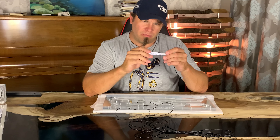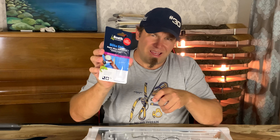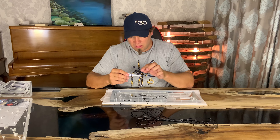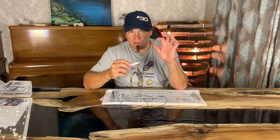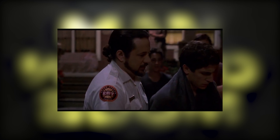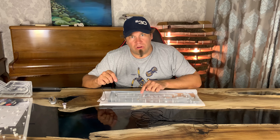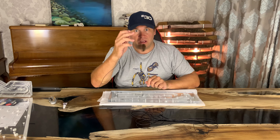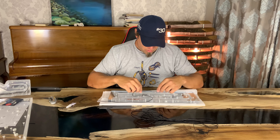Once you're done measuring the O-ring length, you take it out and glue it together with a super glue - we call it Blitz Stick here, a super runny glue. It's a bit booby-trapped because when you puncture the cap and squeeze on one end, the glue inevitably runs over your fingers. Make a nice square cut because that makes gluing the pieces together so much easier. I would recommend you do not design your plate to have sharp bends, because getting the O-ring to stay in a sharp bend is really hard with such a small thin O-ring.